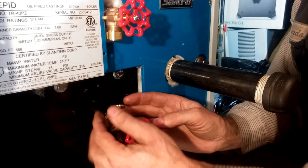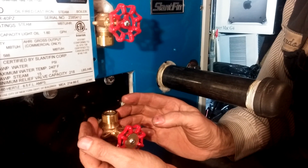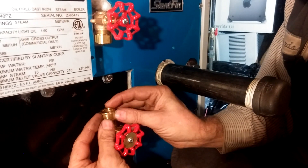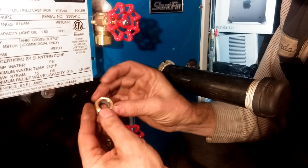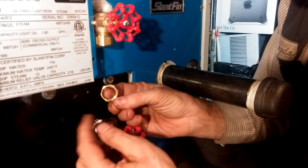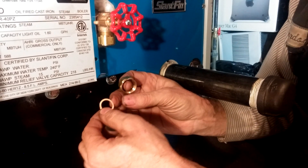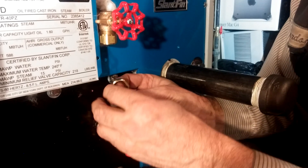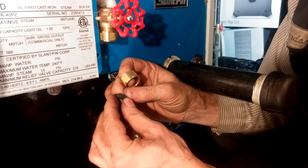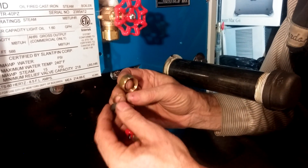This is a setup of a steam boiler sight glass. What you have is your brass nut, a rubber gasket, and inside a friction washer. This doesn't look like much, but they are nice when you have to tighten — it allows this to slip by and not un-thread itself.